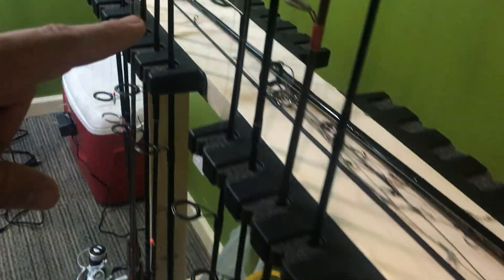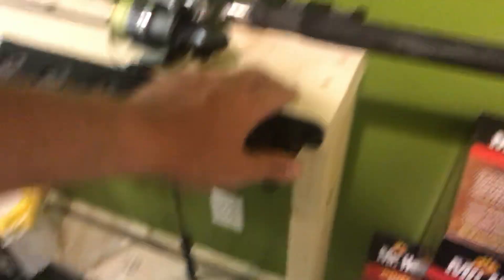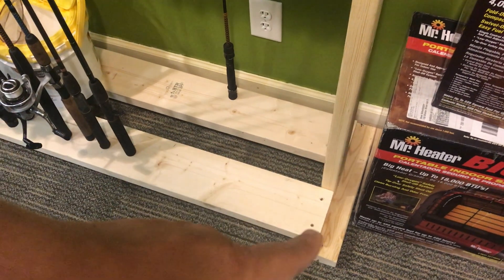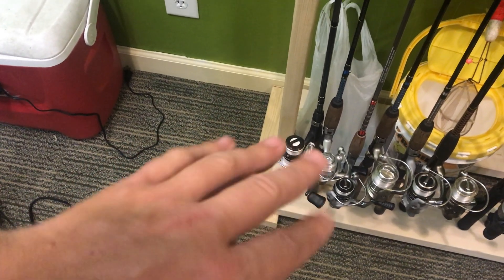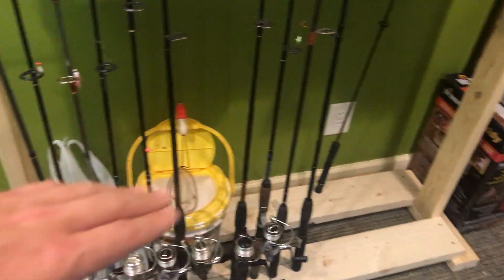Back to this: I did the upright, then the cross beam. I set that down and evened these out so they were in line with my uprights. These are your 2x6s that are 47 inches long, so each one is the same length — makes it a real simple duplicate cut, a stack cut. Line them up on this side, do one at a time, then come over here and space your foot out so you can line it up evenly with that one. Push it nice and tight, put one screw in, then the next screw, and that side's done. Then duplicate that process on the other side.